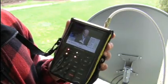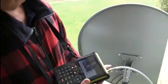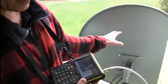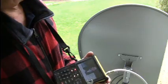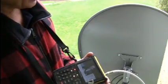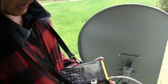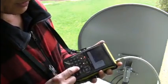The beauty about this meter is how easy it was to come over here, make my marks, move the dish over, and adjust my one or two degree elevation — and that's for the west coast example. Bingo, I had signal, and I was able to fine-tune and peak the satellite immediately. The only thing I need to do now is adjust the skew on the LNB and I'm done. I know I have pretty good signal quality as it is.